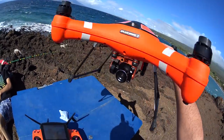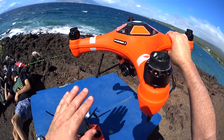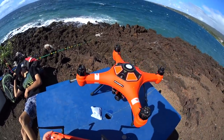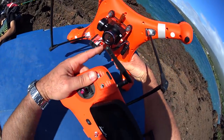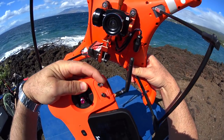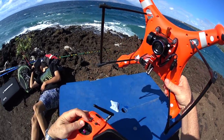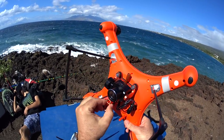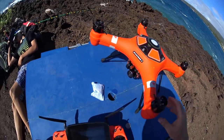Of course it's not stabilizing the roll — there's no roll motor for the gimbal, just pitch stabilization. Your horizons stay nice and flat. The other function of this one is the built-in drop. Flick the switch for airdrop — let me bring this over so you can see the servo. We flip this airdrop down and watch the servo as I flip this — see that? The whole thing releases. This can hold a couple of pounds. It's a stainless steel mechanism and fully aluminum bracket, so that thing is going to hold up to quite a bit of weight — as much as this drone can carry, which is about two pounds safely.